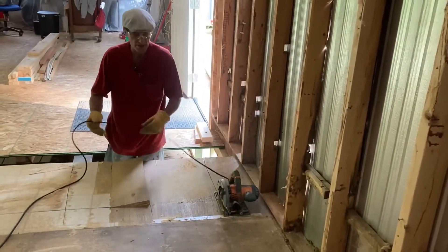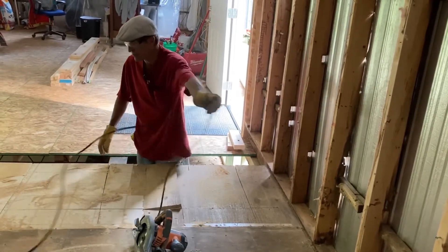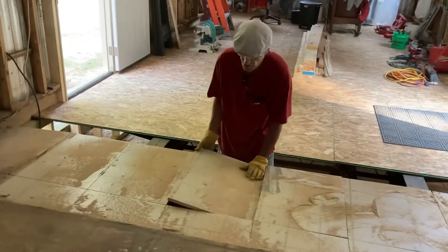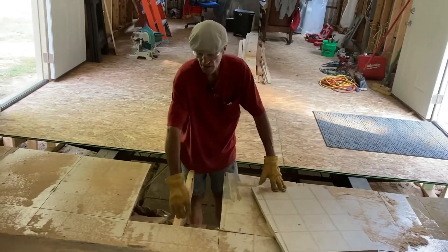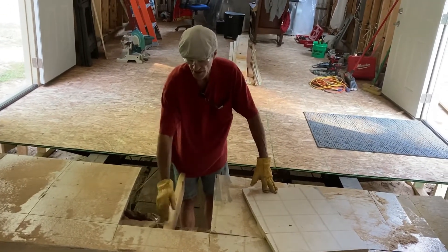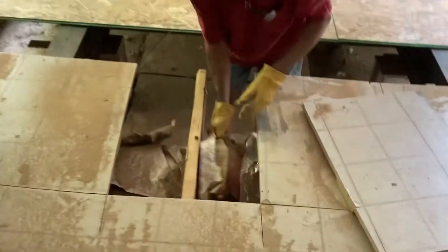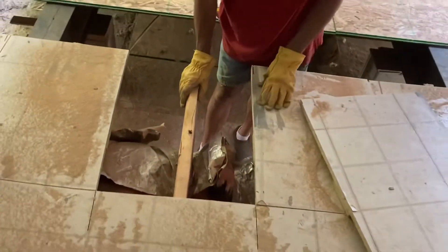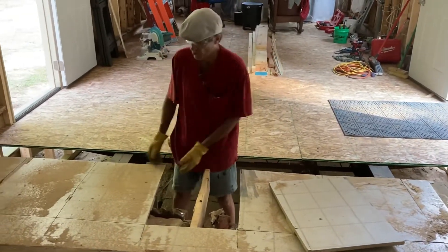Let that go all the way before you lift it up, at least with this saw. Now we're gonna do a demonstration — I'll come over here, probably where the original floor is, it might be simpler. It generally comes right out — see that, comes right out, done. Then we take the saw off and cut. After maybe another section, we'll wait and see how it's laying. Bring the camera closer — it's laying across a metal cross beam right here, goes all the way across. We want to get to the next one, which is about four feet over, before cutting the joists, because we want to make sure we still have some support.